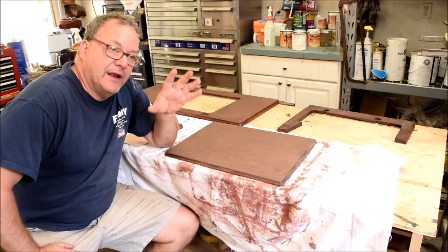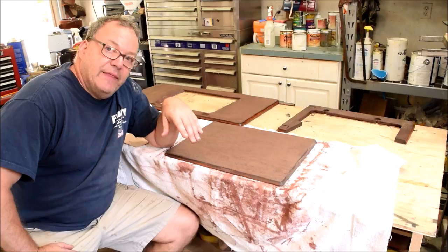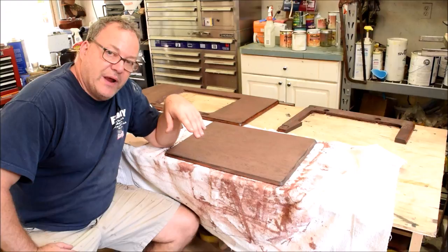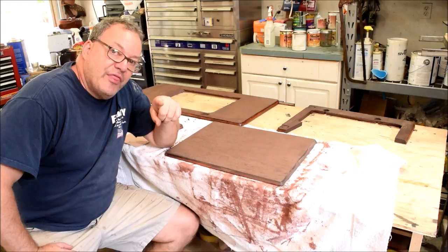I'll bring you back tomorrow. We'll sand these off — hopefully we won't have to recoat them with more grain fill — and then we're going to get onto finishing this wood. It just needs to get some lacquer sprayed on it and then we're going to have to match the colors however they come out. I think we're going to be pretty close. I think we may have to put a little bit of brown on the case, but it's not a big deal. Thanks for hanging out with me in the shop today, and I will see you guys in the morning.